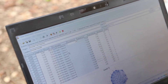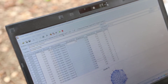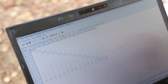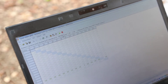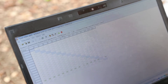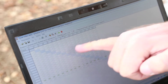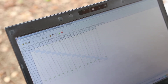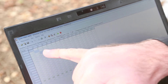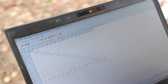We've entered all our data, we're talking to all our sensors, and the shape of our tree has been inputted — everything is ready to go for our measurement. The tab we want to look at while taking measurements is the delta percent option, which is your error value. You want to make sure these values are below 10 for the most accurate readings. To get them below 10, my assistant Christopher will tap each sensor at least 10 times. You can tap more than that, but we've found at least 10 times gets those values beneath 10.